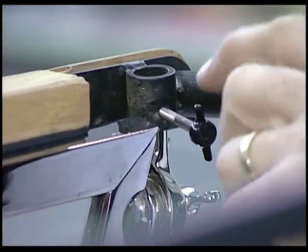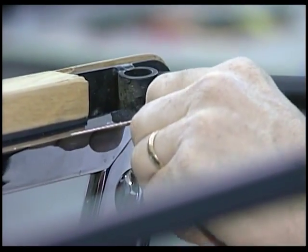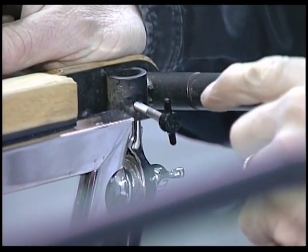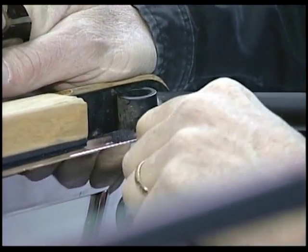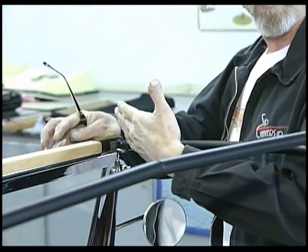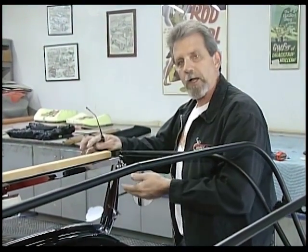The third important thing is putting a detent on the post. These thumb screws are machined to a point — run them in hard on the post so this is all set down exactly where you want it. Run them in hard, put a little mark on the post, then come back with a little eighth-inch drill and just drill a little detent in that post. That way when you tighten this up it's going into a small detent and there's no way it can come off. A lot of guys even drill a larger hole and go all the way through — that's fine — but definitely at least put a detent on it so this thing cannot come up.